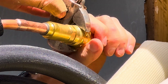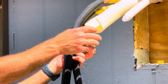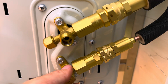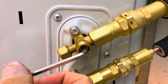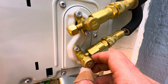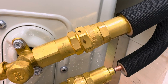Next we connect the tubing. They've got protective covers to keep out debris, which is super important. Connect the largest copper tube first, followed by the second one, and tighten them down to 25 to 30 newton meters. Then connect the tubing to the outdoor unit — make sure the thicker one goes on top, which is M2. Remove the protective cap, insert your allen wrench or hex key, and turn counterclockwise until it seats up against the ring. Reinstall the protective cap and tighten to 30 to 40 newton meters — don't over-tighten. Apply soapy water to make sure everything is tight and there are no leaks, then insert the pins so nothing backs out.